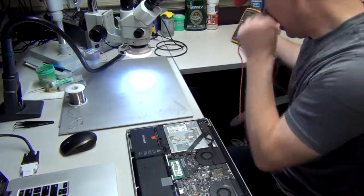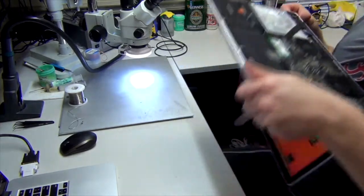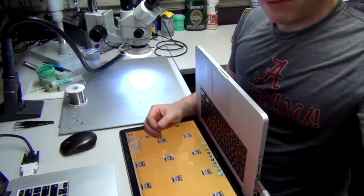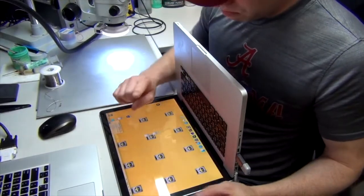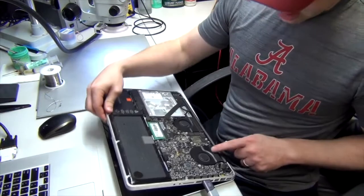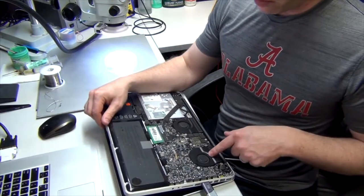So what we're going to do is we're going to go ahead and power off the machine. I'll show you another symptom it's having. So you unplug this, and when you unplug the power, typically what's going to happen is it's going to turn right off immediately. But notice what happens. See how the screen dimmed? The fans are still spinning. So something's going on weird here.